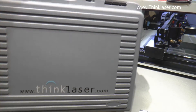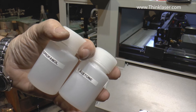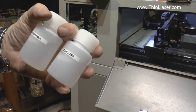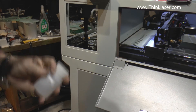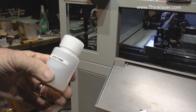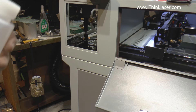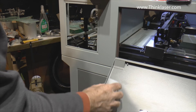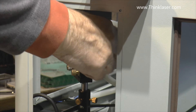The laser very kindly provided a case full of pieces which is basically a lens and mirror cleaning kit. We've got two chemicals: isopropyl alcohol and acetone. Isopropyl alcohol is quite a gentle cleaning agent and dries off very quickly, but acetone is a lot more aggressive - a great material for a fairly substantial clean on the mirrors. The mirrors are not as sensitive as the lens, and since these are molybdenum which is a very hard metal, acetone is not likely to have any serious effect on the surface finish.